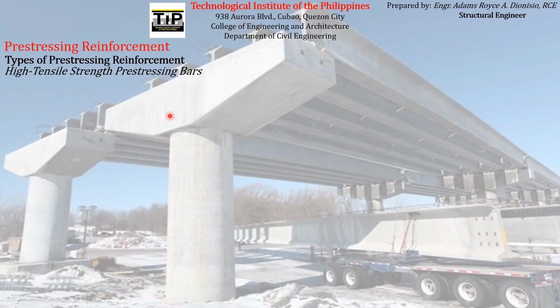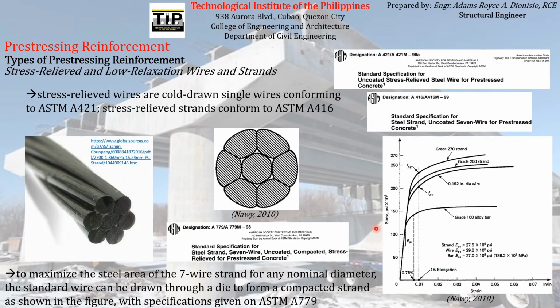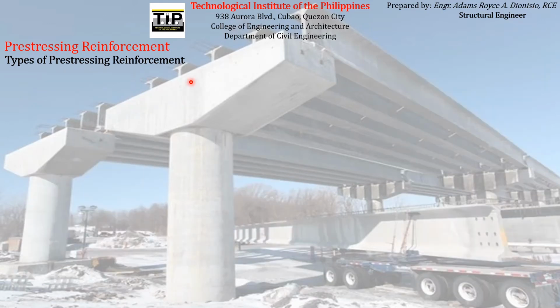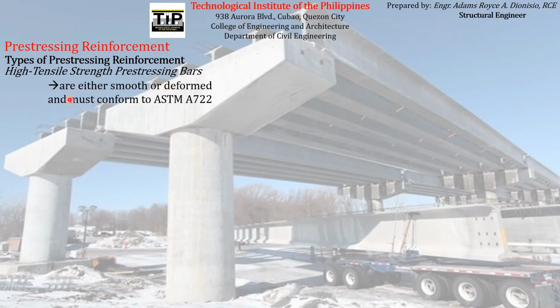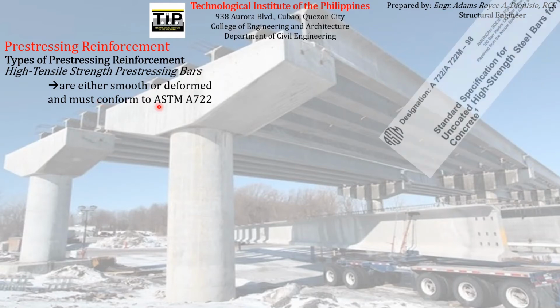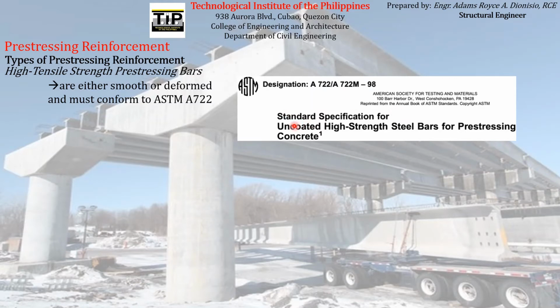Now let's go to the bar. What we have discussed so far are the wires and strands, the stress relieved and low relaxation wires and strands. Now let's go to the bar, which is specifically the high tensile strength pre-stressing bars. These are either smooth or deformed and must conform to ASTM A722, the standard specification for uncoated high strength steel bars for pre-stressing concrete.